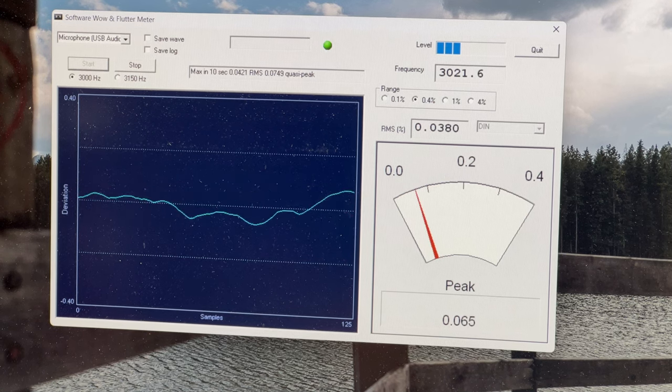All right, so the last of the caps are done. There's one I'm not sure about, and it's this one right here. It's the same value as this little guy, but unfortunately I'm completely out of anything that's smaller than this, so I had to go with the big one up here. This is a 50 volt cap. I don't know if this is going to work because of clearance, but it's the only thing I have, so I'll try and make it work. It should fit. I don't know.